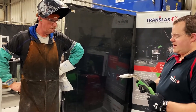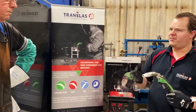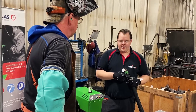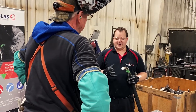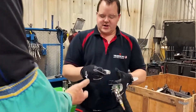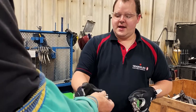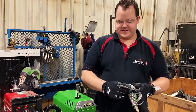The third concern we get asked a lot in the industry is: how do you pull out the smoke, the fume, from the welding process but not pull out the shielding gas and cause a porosity issue? Well, that's the main secret to this gun — it's the nozzle. I'm going to pull this nozzle off and show you. This nozzle is designed around the philosophy of a cyclone, or a thunderstorm. At the eye of the storm, it's usually calm. At the eye of this nozzle, we have zero air flow.